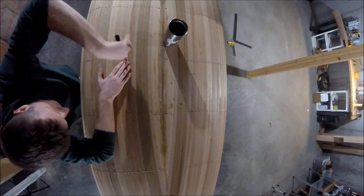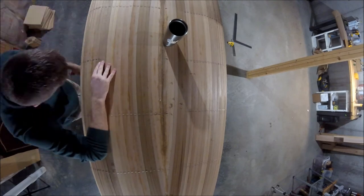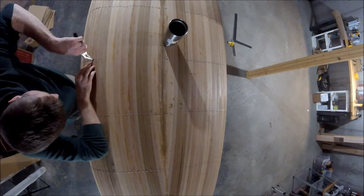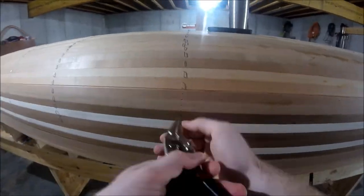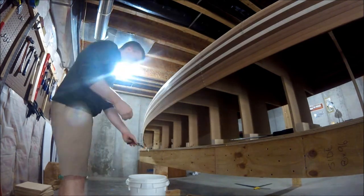The hull preparation began with pulling all of the staples from my canoe. I really don't want to do the math, but I can tell you it is a whole lot of staples. Do your best to be gentle. As you pull, some of the cedar strips may come up, but they should be pretty solid. Just kind of push against the canoe while you're pulling the staple away.